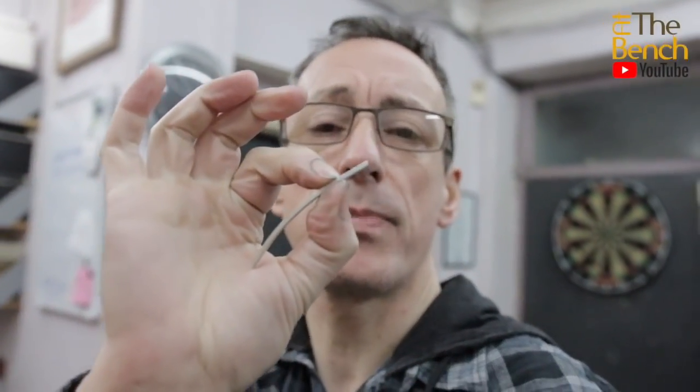And we need to get the wire into the draw plate to be able to pull it through, drawing down wire. Now, this is square section, about 2.5 millimeter square. I want to take this down to around about 2 millimeter. And so I need to be able to put it through the draw plate, but I've got to put a taper onto the end of this piece of wire. So the taper goes through to the other side of the draw plate so I can grab onto it with the draw tongs, pull it through.